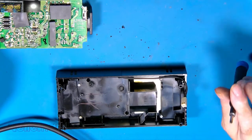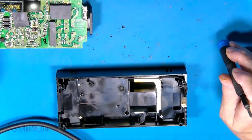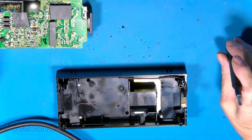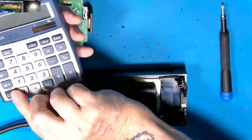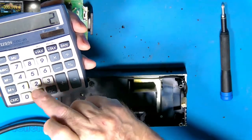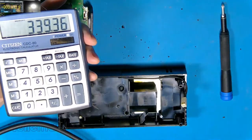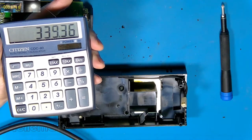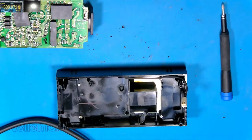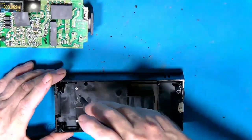The second question is: why does it become 340 volt from 240? Well, the AC comes in and goes through a bridge rectifier which changes it into a peak voltage. If you take 240 volts and multiply it by 1.414 — the root value — you get 339 volts. Or you can divide by 0.707. That's why it goes up that high: when you turn it to DC it is a peak value, because AC is a sine wave and when you rectify it, it becomes near a flat line.